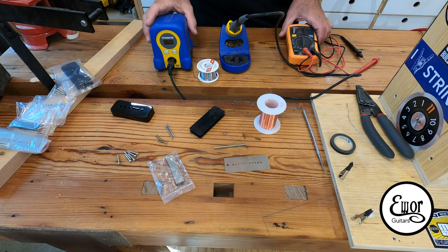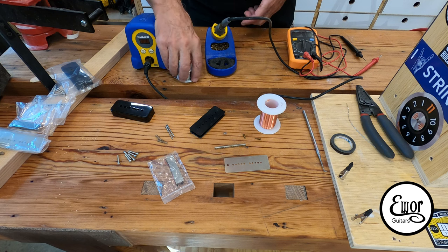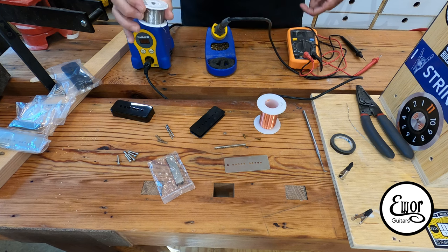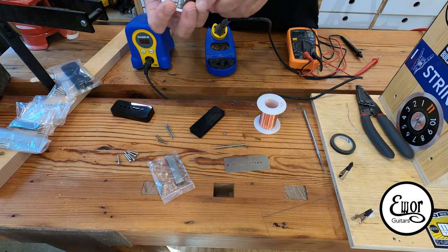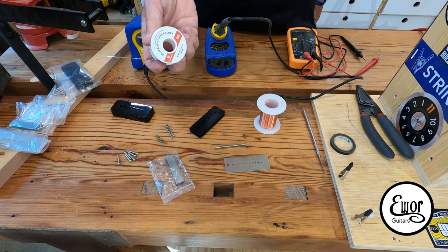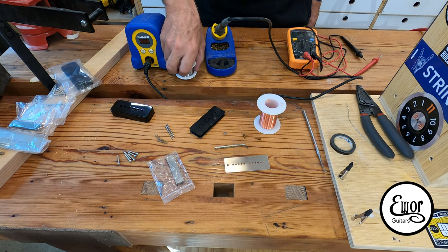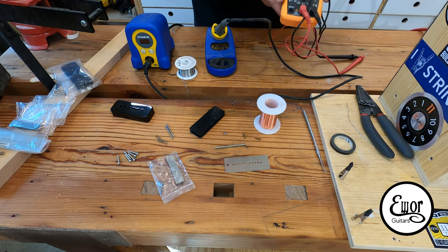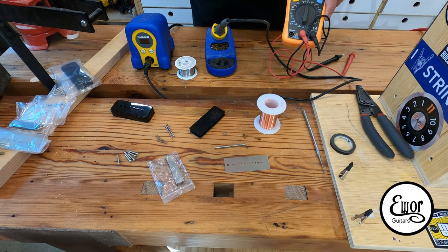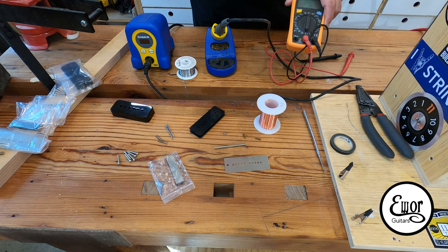Here are a few of the tools I'm going to use. I've got my soldering station and soldering gun. I've got this little skinny soldering wire which is perfect for guitar electronics — it's 60-40 rosin core solder, .032 inch. So it's the skinny stuff, works perfect for this. I've also got a multimeter, which is going to allow me to check the coils once I've wound them to make sure I don't have a break in anything and my solder joints are connected properly.